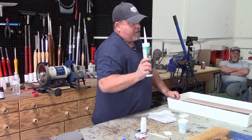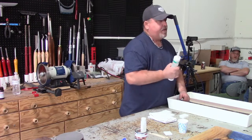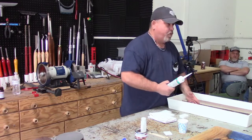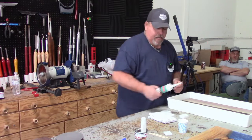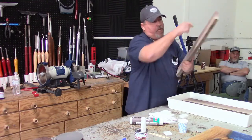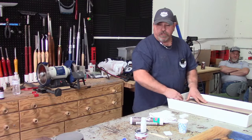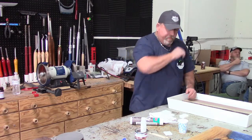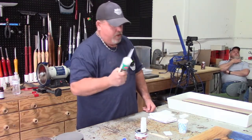The product we use a lot is SealMax. We sell this at our shop. It works great on the HDPE forms — dries within 5 to 10 minutes, and the big thing is it peels off the form easily. Other silicones you're scraping and you don't want to damage your form. I usually just put a dot here and there, set the wood down inside, push down and hold it. For us, it's about speed — we can do 10 at one time and we're pouring. We are the only distributor in the U.S. with this stuff, online and at our shop.